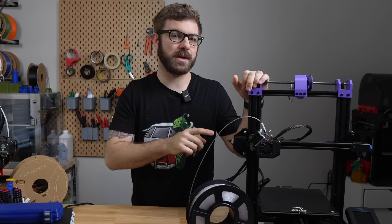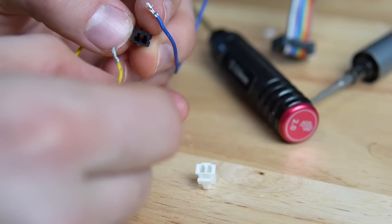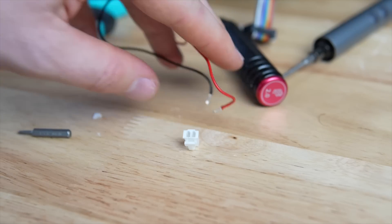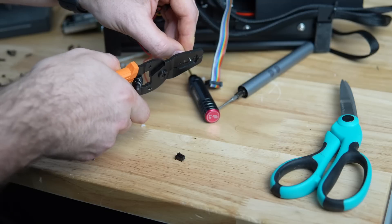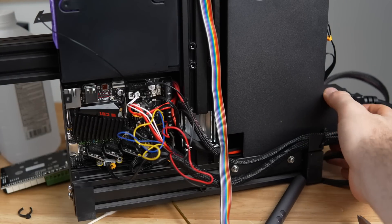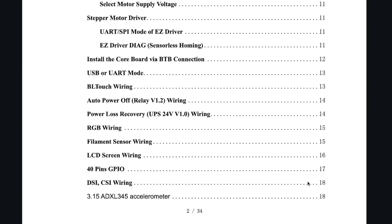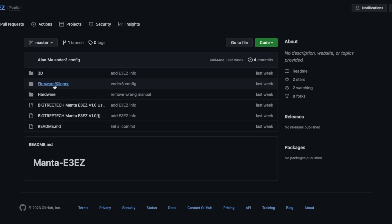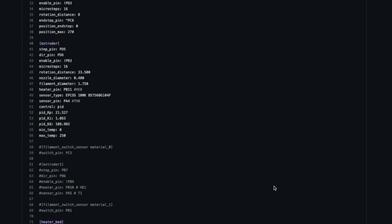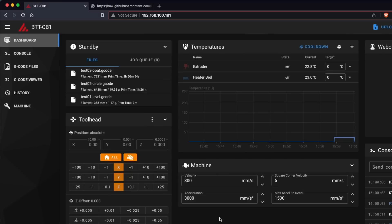I plugged all the cables from the old board into the new E3EZ using the provided diagram from Bigtree Tech. There were only two cables I had to modify. The layer cooling fan had a slightly larger plug than the board accepted, so I removed the pins and used the included connector. The heatsink fan on the stock Ender 3 V2 is always-on, so I crimped that and added it to a controllable slot — now the hotend fan only turns on when the hotend is actually heating up. Bigtree Tech already has a GitHub repository with a detailed 34-page guide covering specs, pinouts, and various settings, plus a pre-made config file with all the pin mappings for the Ender 3. I copied their Ender 3 config, made a couple of small tweaks for my custom setup, and was ready to go.